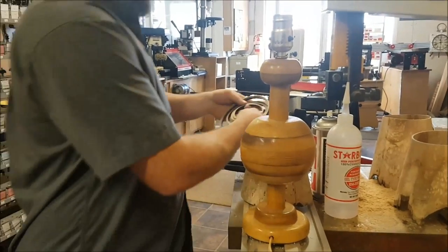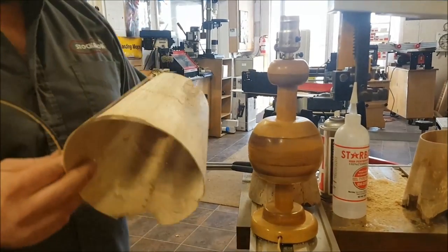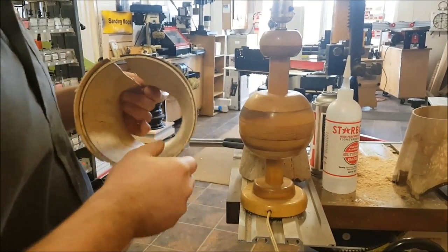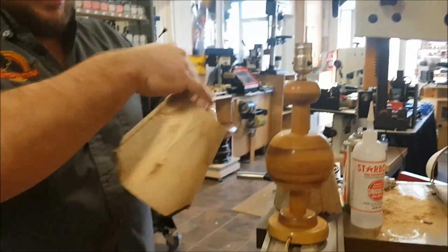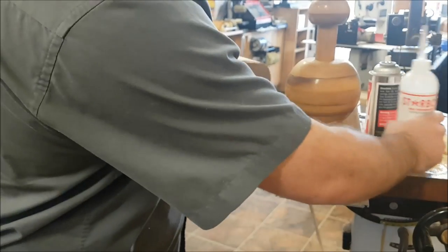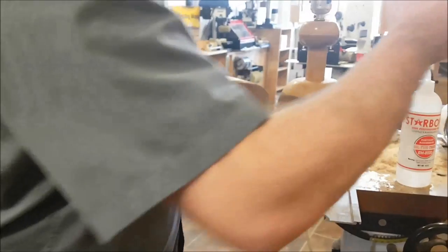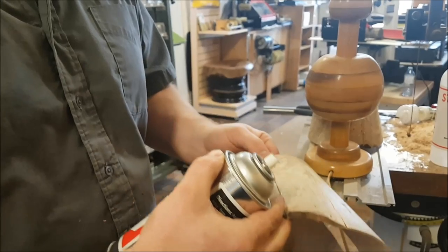I cut these rings and I'm using them as kind of supports. Where I got the big crack in the wood, I just slid the ring in there and that would be my support. Then I CA glued it with the hardener. You can see where I've got the joint in my wood — I used CA glue, and the nice thing is I could hold it with one hand after I glued it, get it lined up, then use the accelerator and it would dry in about ten seconds. You can do this by yourself without having to worry about clamps.